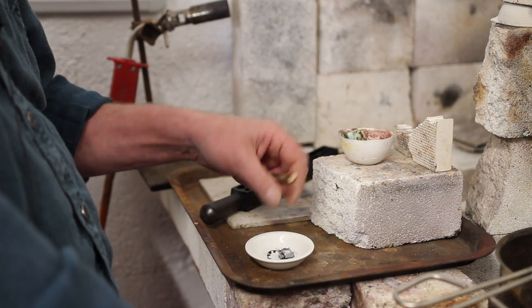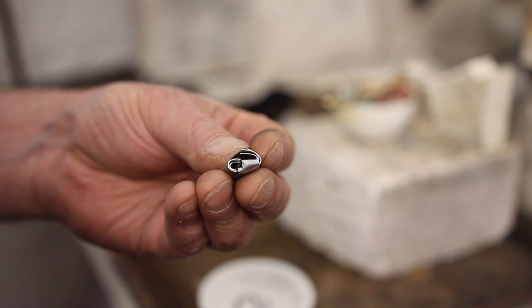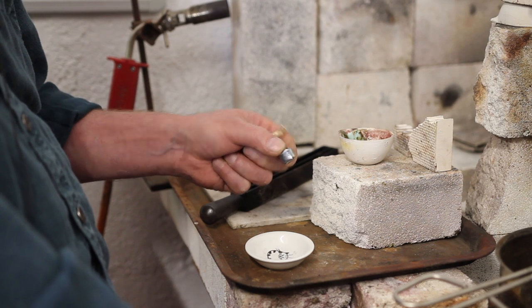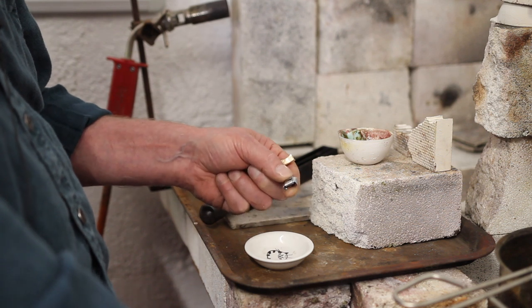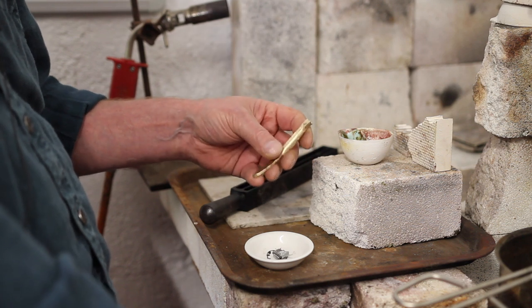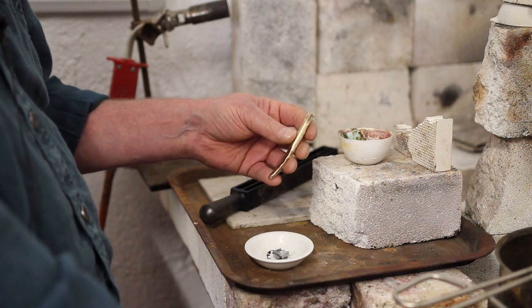So this morning I'm going to be using actual zinc, and of course it's very volatile. It melts very readily and produces a big puff of bluish-white smoke, which is not particularly great to inhale loads of. You add it right at the end, and about 15 to 20 percent of the zinc will burn off. We allow for that, which means the gold alloy consequently is ever so slightly higher than 9 carat.